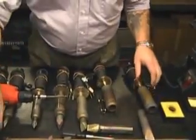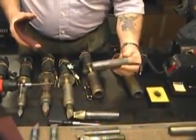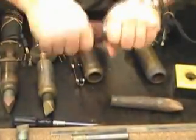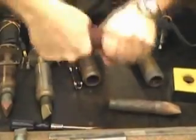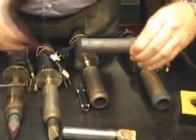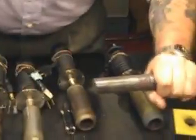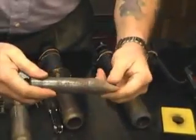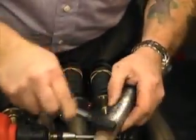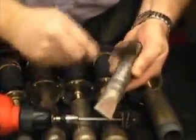And the next thing is the tip shank. As I said, if you properly maintain these often and don't have this kind of buildup, it's not too big a deal to go in here and lightly remove this oxidation and buildup that might be on the shank of the tip. Once it gets to this level, it's going to be very hard to really get that off adequately. In that kind of situation, what you're probably going to have to do is take your wire brush and get some of this thick buildup that's up in here out of the way as much as you can.